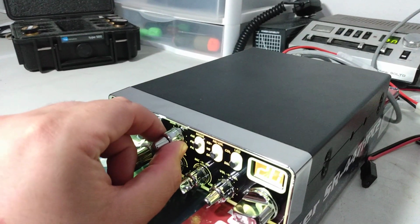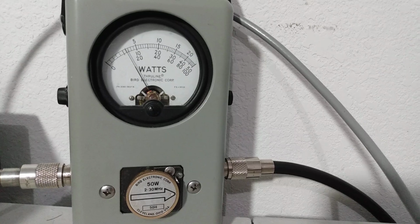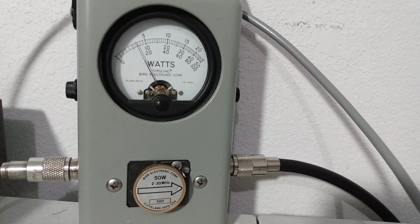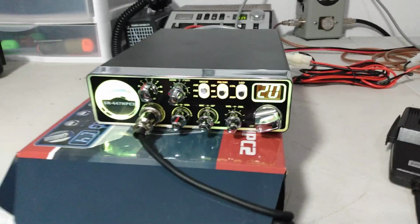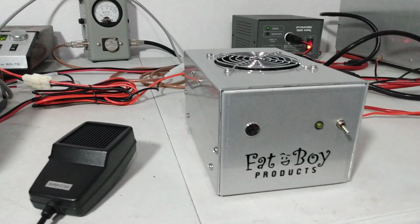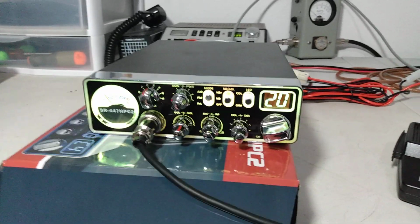And then here we go. Back down to 9 o'clock. That's about a 6-watt dead key. Audio just creeping past 10 watts average on audio. 15 on the whistle. So that's what we're working with here, and I will show peak output on the 1,000-watt slug with this thing wide open once we're all done. I'll have to remind myself, but once we're all done testing the amp, I'll turn this wide open and show you the PEP output on a 1,000-watt slug, so you know what the radio will do by itself.